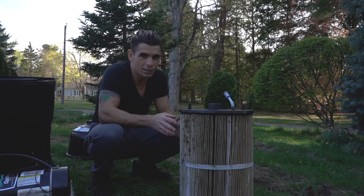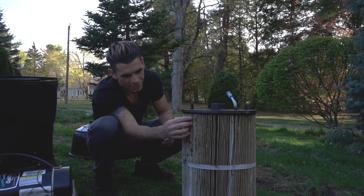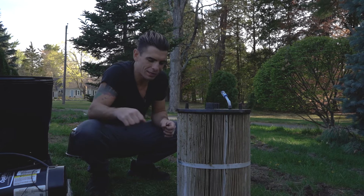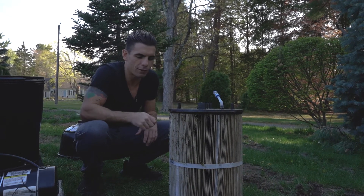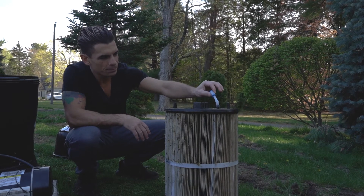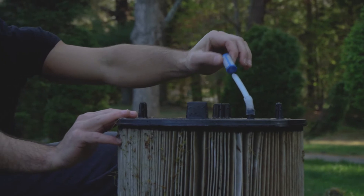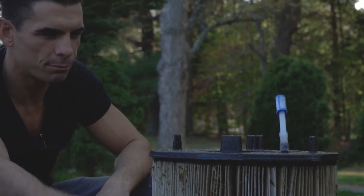If you let this thing sit for a whole year — I've had customers who don't have many trees and only have to clean it once a year. If you have trees, you get a lot of debris, which isn't really the big deal. The big deal is the dirt that gets inside these pleats, and that's why a power washer does such a great job. If you have a powerful power washer, don't get it right up to the pleats and destroy it — start about four feet away and get as close as you need to clean the whole thing. On the top there's a little air relief net that directs air up through this release nozzle, which lines up directly under the air release valve when we go to prime the system. It's a small part but very important that it stays on.